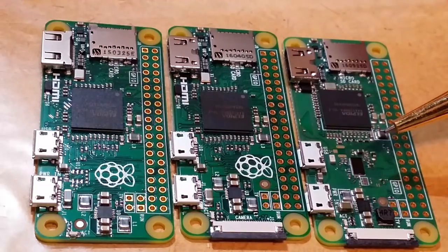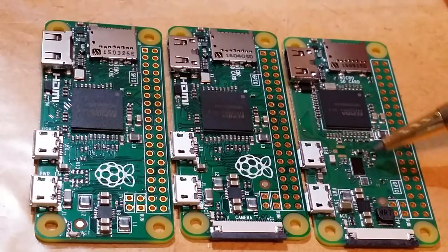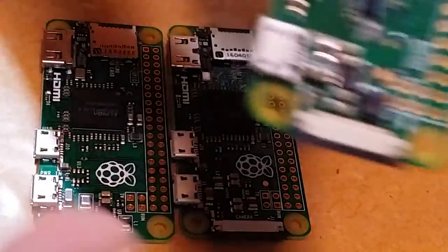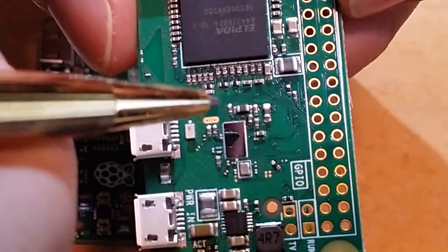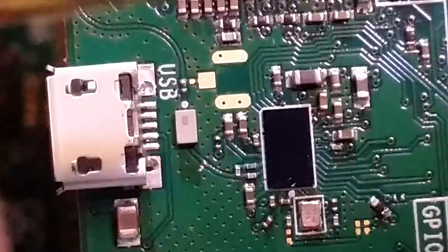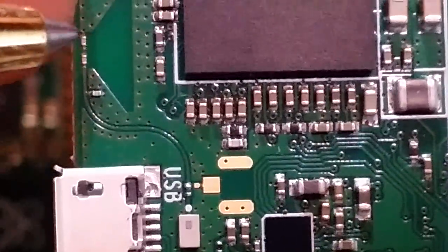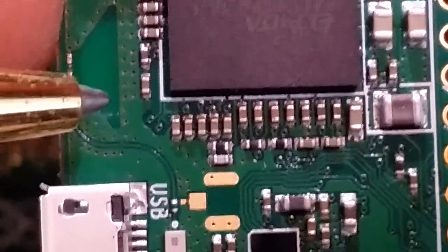The wireless components are right here. These three solid pads are for an external antenna — you can see them if you look closely. There's a resistor here, and that's the antenna trace leading up to here, with another two resistors. This whole triangular area is hollow — if you shine a flashlight through it there's no wiring, just a hollow area.